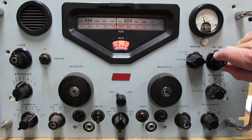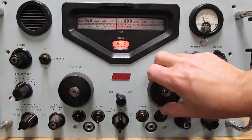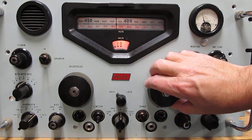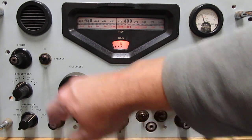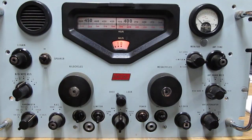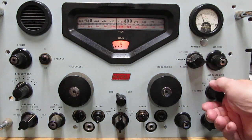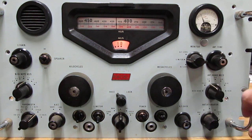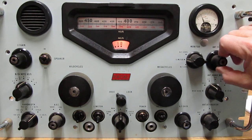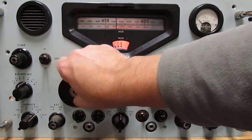You can back the attenuation down a little bit and you'll notice the noise level decrease, and just be sure your antenna tuning is peaked up. If you want to copy the broadcast band, you would go way down in here — turn your BFO off, be sure your AVC is on, IF gain is up. You're going to be down in the broadcast band, one to two megahertz on the upper side of the broadcast band, and you'll pick up stations.